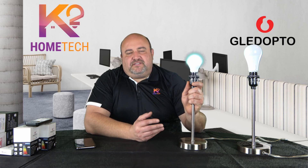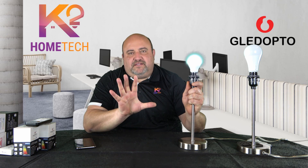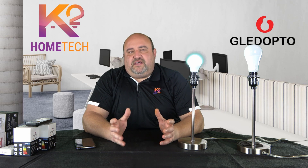I'll show you how I do it — it makes it a lot easier and removes some errors. Two things to remember: you have to do it exactly five times, and you also have to wait until the LEDs turn on. So if you have an LED strip controller you're trying to reset, you have to wait until the LEDs come on before you unplug it again.